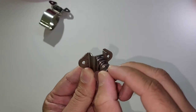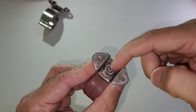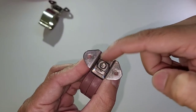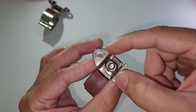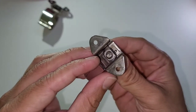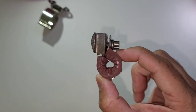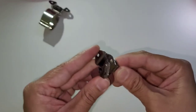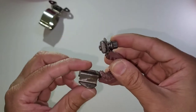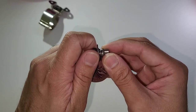The 12-point variant also has a rectangular slot — you align the nut with that slot and then close it. You can see the shape of the nut: the walls of the clamp will block the nut and hold it in position. All you have to do is tighten the bolt and the locking is done. However, as I mentioned, when the harness is there it will keep the clamp in a stress position, so before tightening you have to make sure the nut is properly seated.